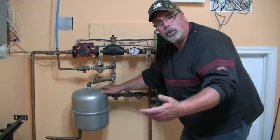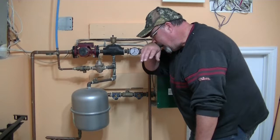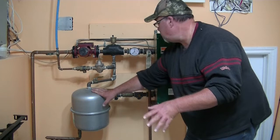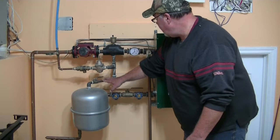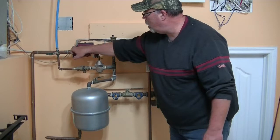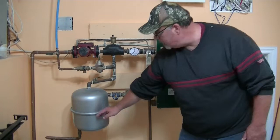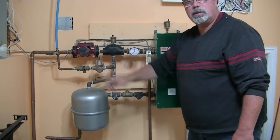Basically, like in your cooling system in your car — if the water expands when it gets hot and the system has too much, it can put it into here. If it's really too much pressure, then it'll come out here. This is another pressure relief valve, and it will just dump it on your floor. Once your system is filled, the pump will push the water down this way, down towards the floor — I'll show you the tubes in a minute. Then it comes back up through the floor into this pipe, into the boiler, gets heated, goes back out through here, and it just cycles through the system again.